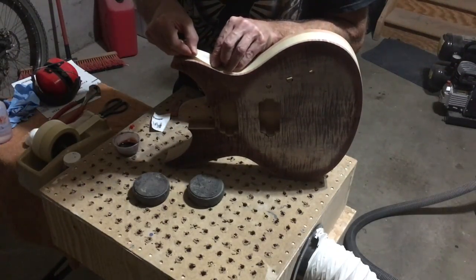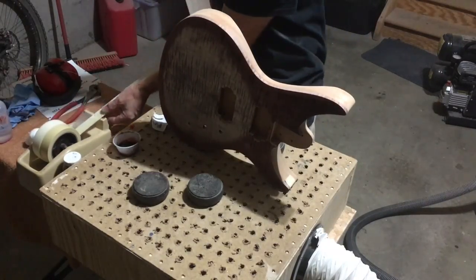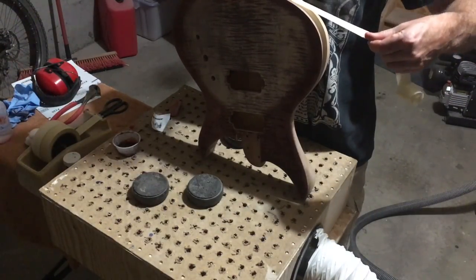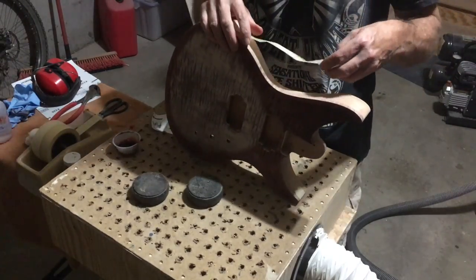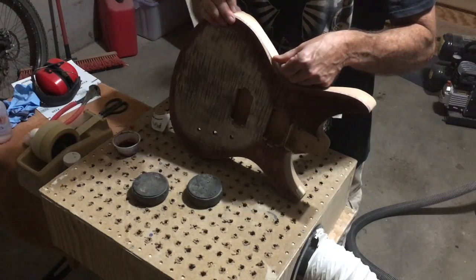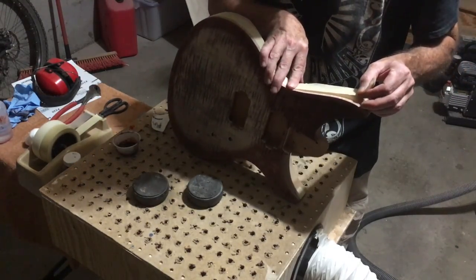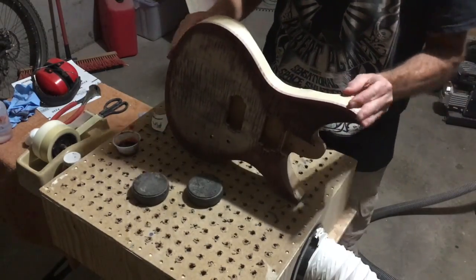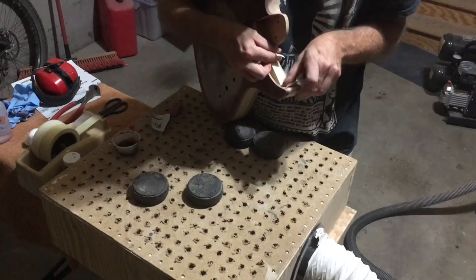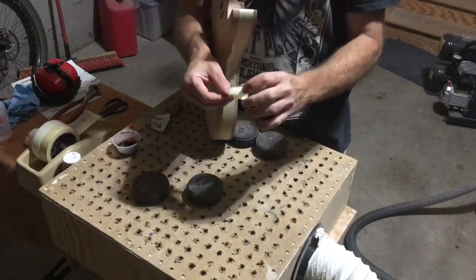As I mentioned before, I'm using an aniline dye to dye the wood on this guitar body. Specifically, the product I'm using is sold by Keta Dyes, which I believe is out of Wisconsin — I'll put a link in the description. They sell a kit containing five different dye pigments: the three primary colors — blue, yellow, and red — plus brown and black. From those five colors, you can get just about any hue you could ever imagine. These pigments come in powdered form, and the reason I like aniline dyes is because the pigments are ground to such a fine particle size that they soak deep into the wood and give you a much more consistent and more intense result. Aniline dyes are the best way to go when it comes to dyeing wood.